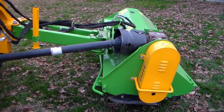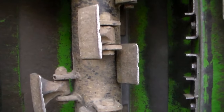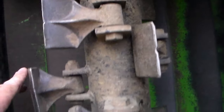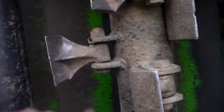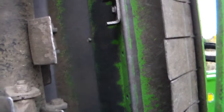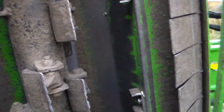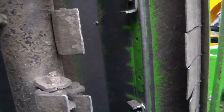Here we are underneath. The stuff I was taking down was like 4-inch trees and I'm sure there were a couple of rocks I wasn't aware of. These teeth are holding up very, very well. I am going to replace them all once I'm done with this project — these will be my beater teeth. Make sure you check these every couple of hours; I had a couple where the nuts were completely off but luckily the teeth didn't come off. I don't blame the equipment — I am definitely beating on this machine.